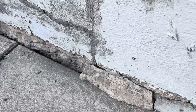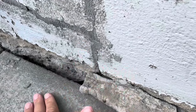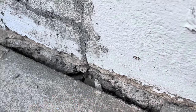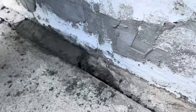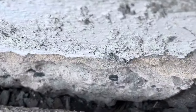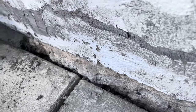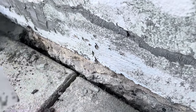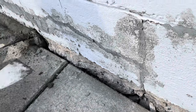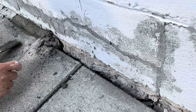Something else we're doing with the Fast Plug here — you can see where this patio walkway meets the basement block, and it had all these broken chunks. We just took them out and we are using the Fast Plug. You can see how far down it goes — it's not too deep — but each section is three scoops and then one scoop of water. It only covers about this much of a section, depending on how deep it's going, but we're using it for this too.